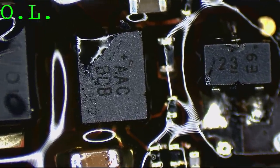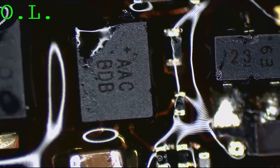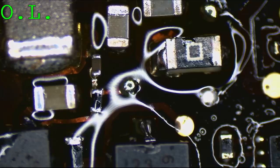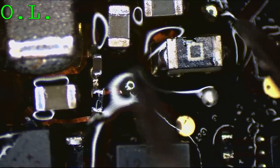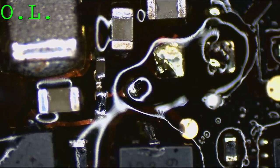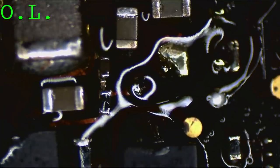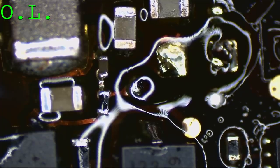It was not liquid damage. If it was a CD3215, when I disconnect the link from PP3V3 G3 hot to the charging chip, even when I disconnect the link between it and the rest of the board, it's still only 1.7 volts. He's already fixed two or three boards that I couldn't figure out or destroyed, so I have faith. I think more people should have faith in it now.